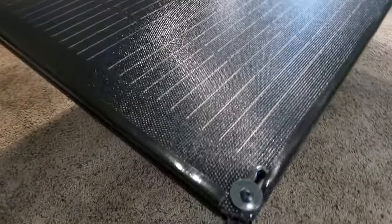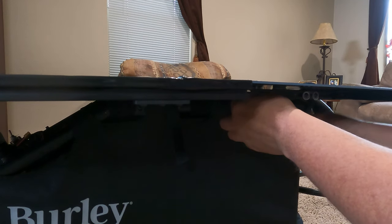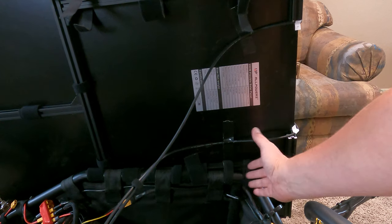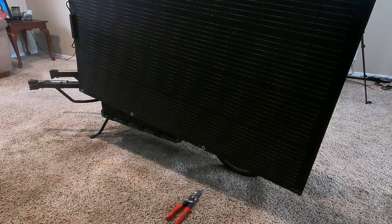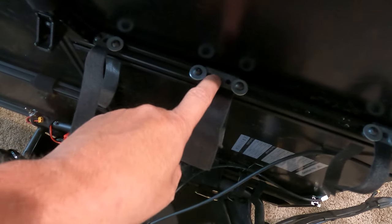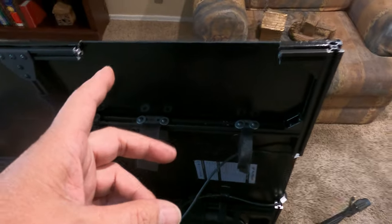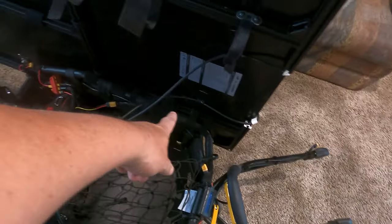In addition to the tape, I've added eight washers around the side to ensure the panel doesn't rip off the mount. The trailer is held on by three Velcro straps on one side — the side I'll primarily open it from — and quite a bit more Velcro on the other side acting as a hinging system. The two batteries inside act as a good counterweight for the solar panel at this angle. I also added washers with a little steel strip against the rails to prevent the solar panel from sliding back and forth — during testing at about 32 mph it slid back a couple inches.